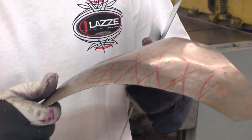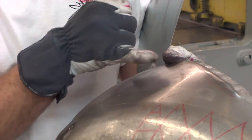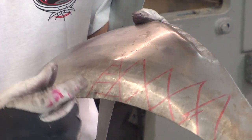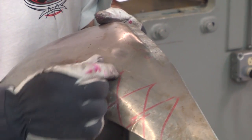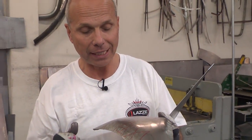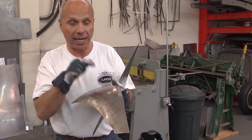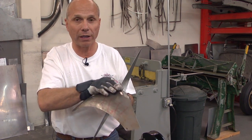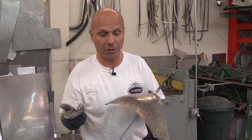When we're using the deep shrinker, we can shrink in like a pie shape — high pressure on the edge and less the further in you go. You can go even five and a half inches deep in, then take a new bite: hard, less, less, less. You can get a smooth radius like this. With the deep shrinker it's much harder to just shrink the edge and get the same shape — you need to roll that up with the English wheel instead of shrinking so much.